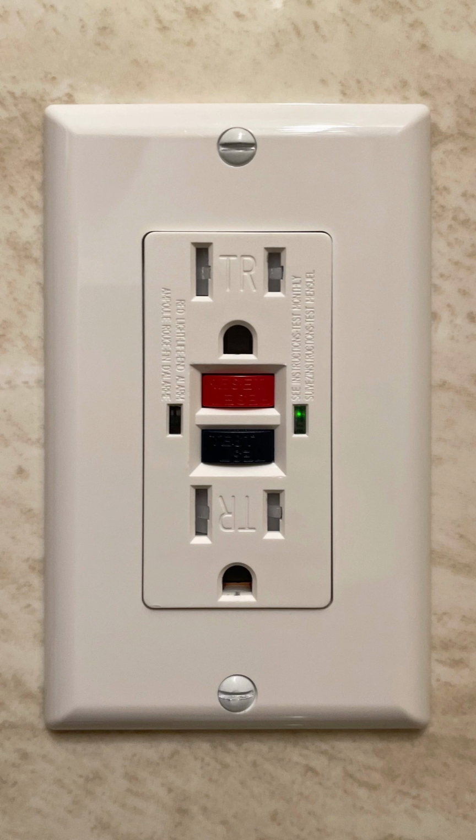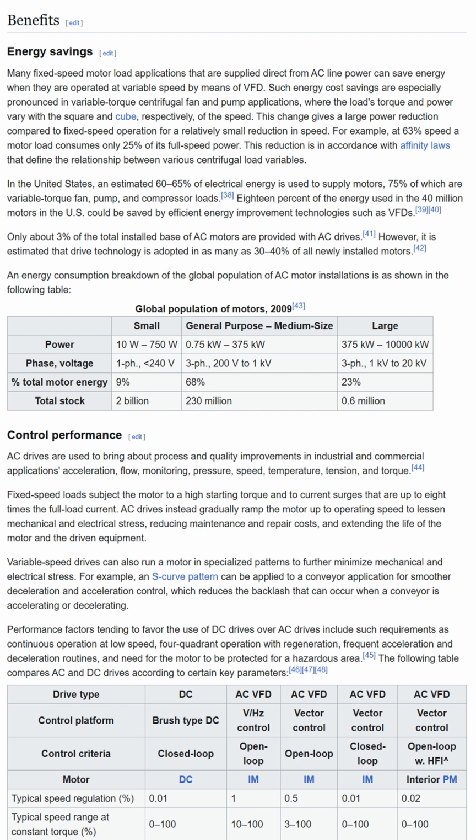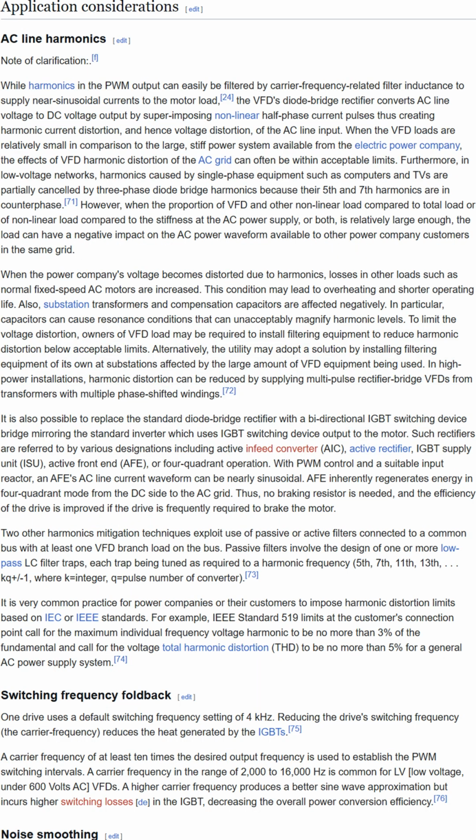They're great safety features. The trouble is that when you pair them with a VFD, or variable frequency drive, they don't get along. Now, a VFD is great to have on a pump. It lets you control the speed of a motor and really lets you dial in on some performance point that you're looking for. It makes the whole setup really efficient and performs exactly the way you need. You can do lots of great control features like constant pressure, constant flow, constant temperature, whatever. Anyway, great feature. But there's a kind of backflow of electrical current that happens when you're operating a VFD, and it's the exact kind of thing that will trip a GFCI outlet. So if you put a pump that has a VFD on a GFCI outlet, it will trip almost every time.